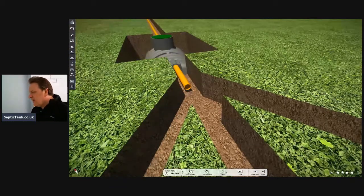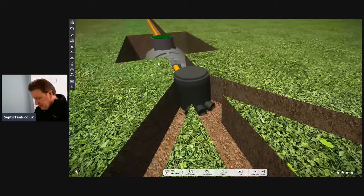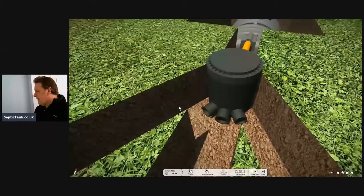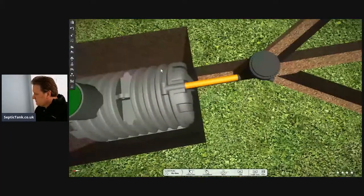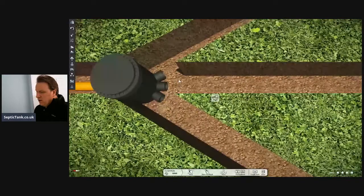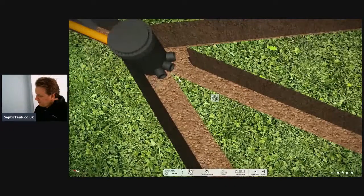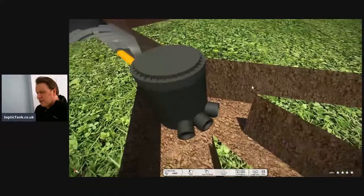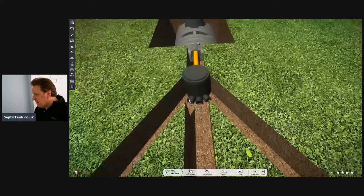Now, on the outlet pipe, you then put an inspection chamber. It's as simple as that. And the inspection chamber, this particular one, if you notice, has got 3 outlets. All right. So everything, as I said, is standard 4-inch. So it comes straight out of the pipe and straight into the inspection chamber. Everything standard 4-inch. Then on the inspection chamber, you've got 3 outlet pipes. Okay, so why am I pointing those out to you? Because the easy drain feeds into these outlet pipes here.